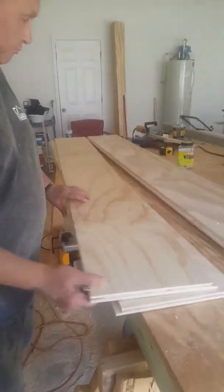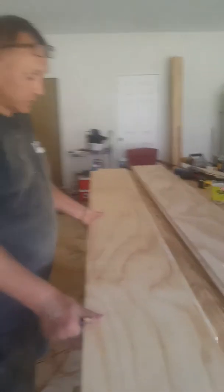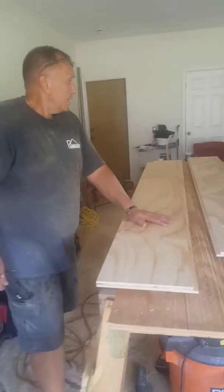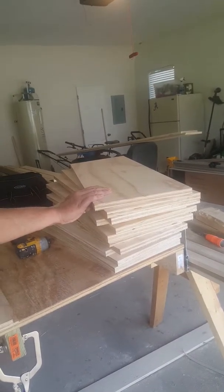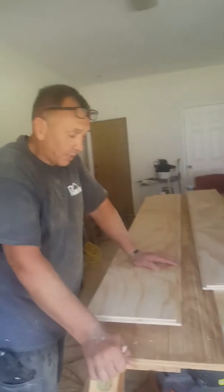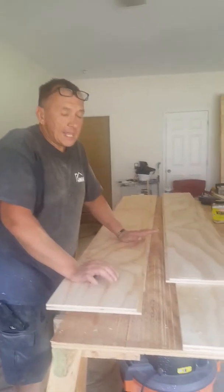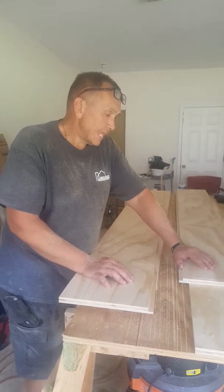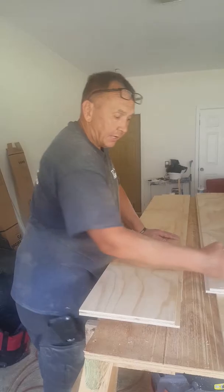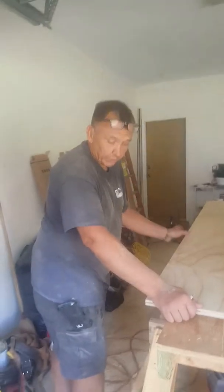It's got a nice finished side, pretty good on both sides. What's not, a little bit of bondo and sanding, you're never going to see it - it's not a stain, it's just a paint. So we've got everything cut down. We have our tops and bottoms for all our boxes, all our cabinets in the closet. There's going to be four cabinets that are identical - basically nothing but movable shelf boxes with rabbeted backs. It's going to be half inch hardwood with movable shelves, and the tops and bottoms are going to be biscuit. There's very few nails in anything we do here at Grace Complete.